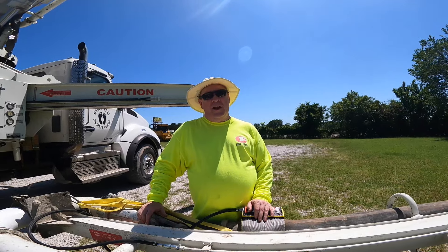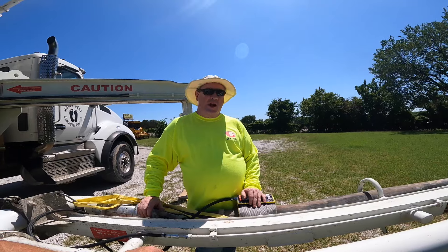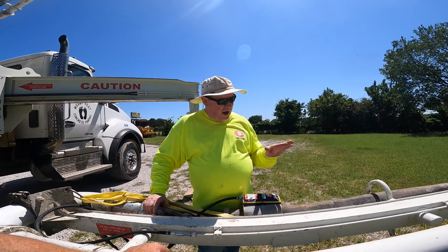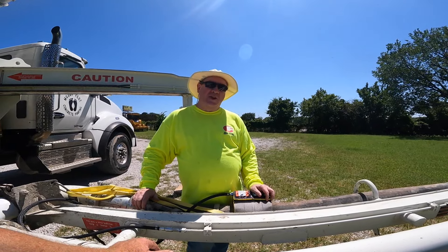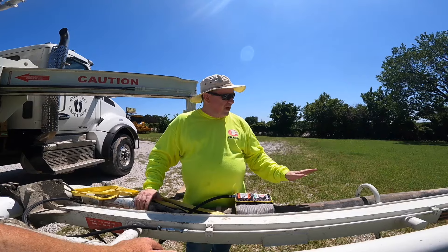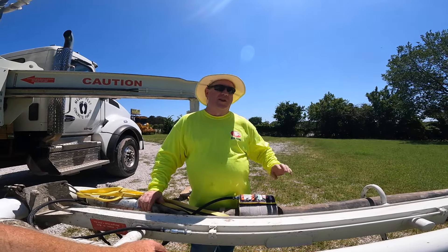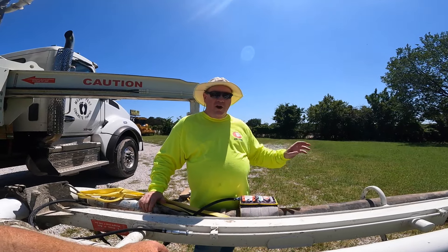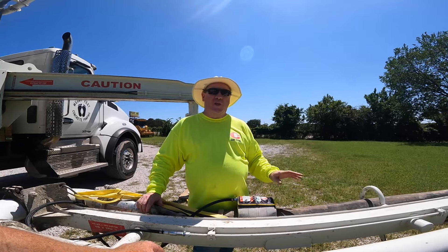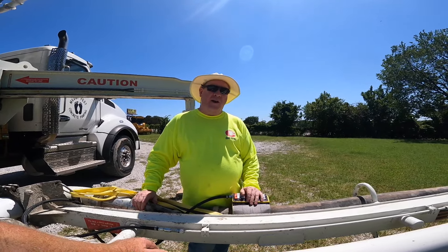Well, the Canadians have smaller rocks so they can use smaller hoses. Up where Scott is, he's got really nice sand — all natural sand, natural rock, really good concrete. What I find is some people with harsher mixes, like down here in Texas with crushed rock and crushed sand, are running a four-and-a-half-inch hose most of the time. That little bit of reduction allows a good steady flow so you get a good stream without turning the pump way up, and the guys can keep up with a good flow while pouring.